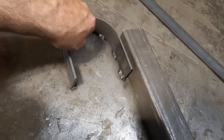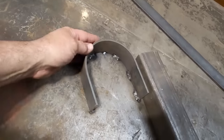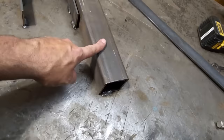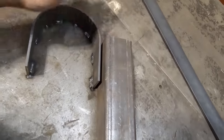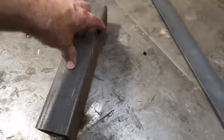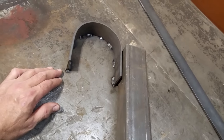After I welded it, I welded it on the inside. I didn't weld nothing on the outside because I don't want no interference or nothing to actually put kinks or anything in the bar as it bends around. And this here now, I got welded on the bench here and here. I only got a tack welded on. It shouldn't have no trouble breaking clear, okay? And I welded it right here and right here. I just wanted to weld it on in such a way that I can easily cut it off the bench later on.